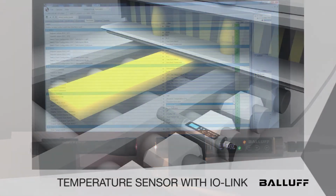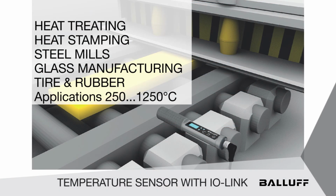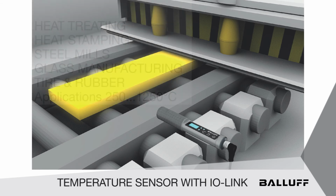Applications for this device are heat treating, hot stamping, steel mills, glass manufacturing, tire and rubber, anything that reads between 250 degrees C and 1250 degrees C. Any application where you're actually looking for that temperature range. So in hot stamping applications, some that we've looked at is actually telling the difference between the hot ingot being in position or not in position. So we can look at the die, see what the temperature is, and then also look at the ingot to see again whether it's present or absent. And also look at the temperature of the die to see what's going on there.